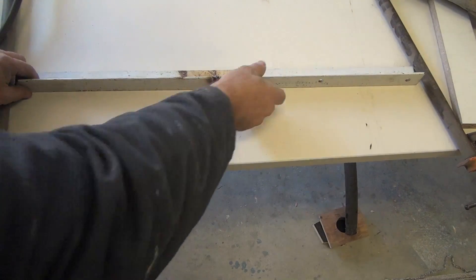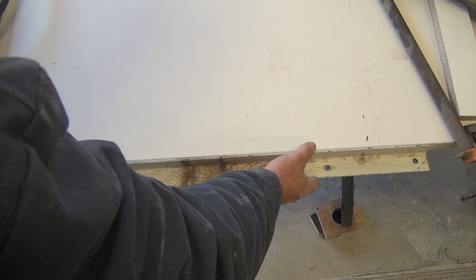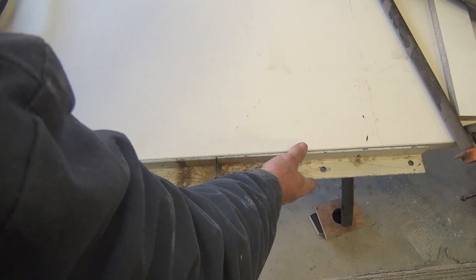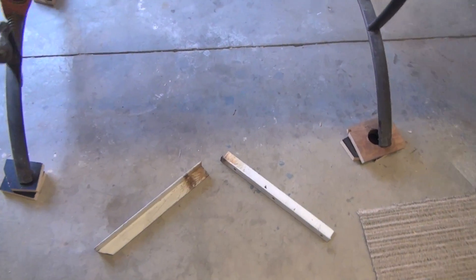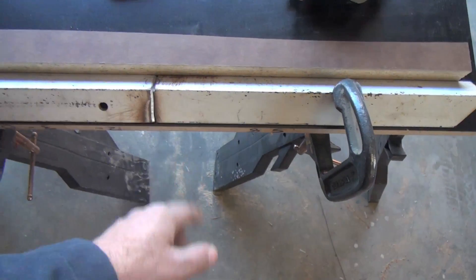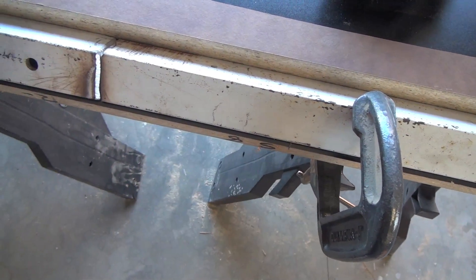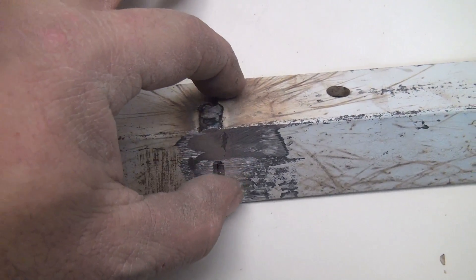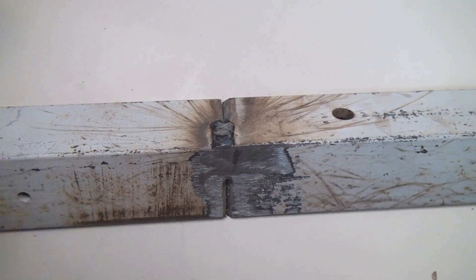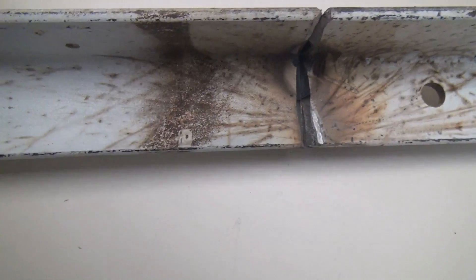I hope that works. I don't know why it's doing that - this has something to do with when it cools maybe. I let it cool down for a few minutes, came back, let go of the bar clamps, and it rocks still. So I have to break the weld. I had to re-cut the seams - cut off about three sixteenths off each side, put a new clean bevel on it. Instead of trying to weld it on flat on one edge, why not just lay it flat. I tried it again, starting from the inside corner going out. This side on the flat is good, the other side wasn't good so I grinded it down and was able to bend it out just a little bit. I'll slowly put a couple little tacks in here and try to get it so I can use this.